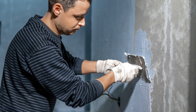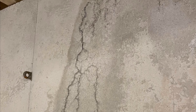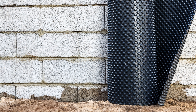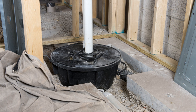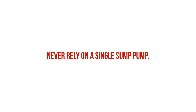For interior drainage, we can't just apply a waterproof coating like Drylok to the interior and call it good. We need an actual strategy, as hydrostatic pressure will drive water through any cracks and imperfections, and new cracks naturally tend to form in concrete and masonry. We need to retrofit a drainage mat against the foundation walls directed to a new interior French drain system discharged to a sump pump. We excavate around the perimeter of the slab to install the new interior drainage pipe, located below the level of the slab by a few inches, set in a bed of clean crushed stone and wrapped in filter fabric. This drainage pipe should be directed to a sump pump — ideally two sump pumps for redundancy in the event one fails, or if you have an especially large basement or a higher water table.